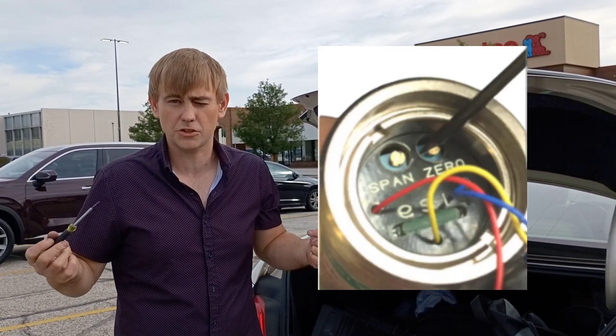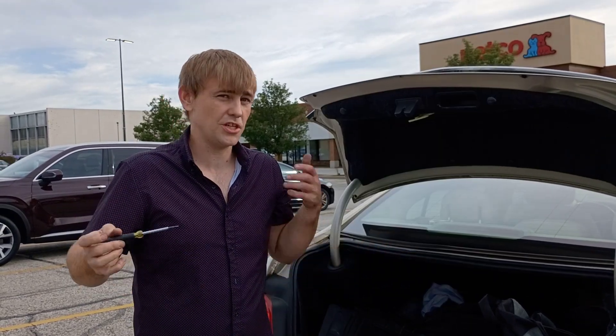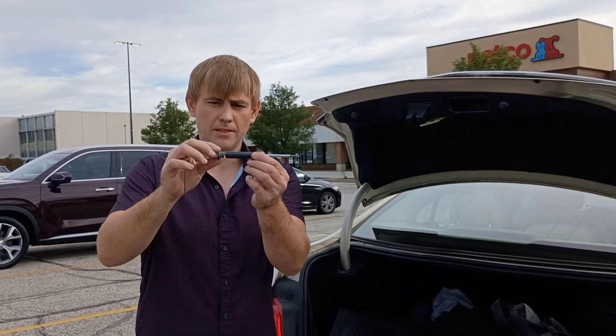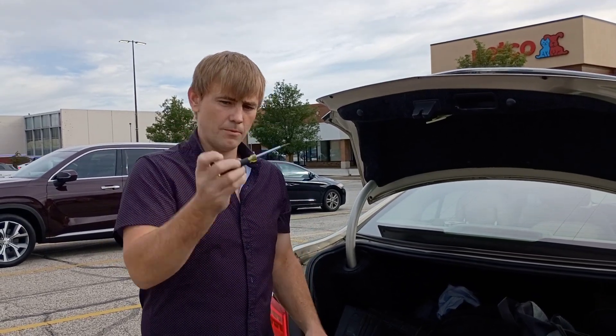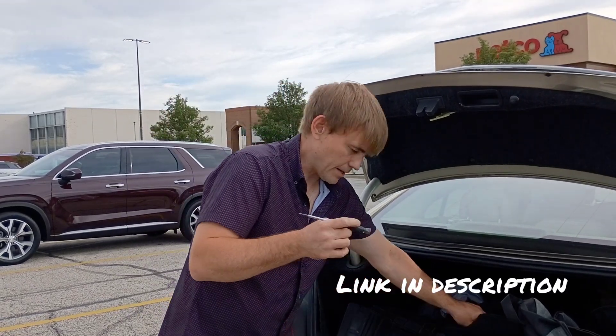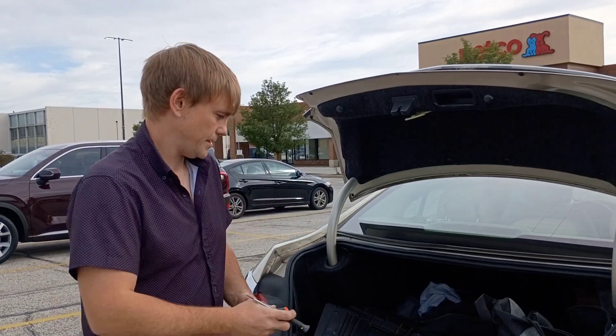This super tiny flathead is good for tuning potentiometers. Maybe you have a pressure sensor or a pressure transducer with a little spot to spin a potentiometer to change the calibration — it's good for that. The reason I like the 4-in-1 is because it's got this little spinny cap on there, so if you're working on a lot of terminals, you just press it up against your hand and spin. That's a good one. You can use a 4-in-1 or just get a small insulated flat blade screwdriver.